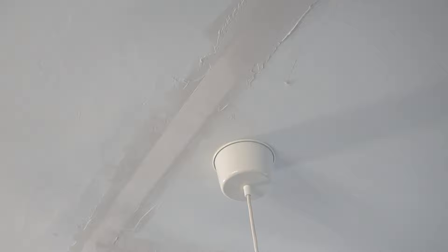This area is where the fixtures are located. There is some cracking showing, so I'm going to go and replace that with paper tape. The previous owner who did the job used mesh tape, and I didn't like how it looks because it was pretty much showing — they didn't add enough joint compound. So we're just going to go over it again with some joint compound.